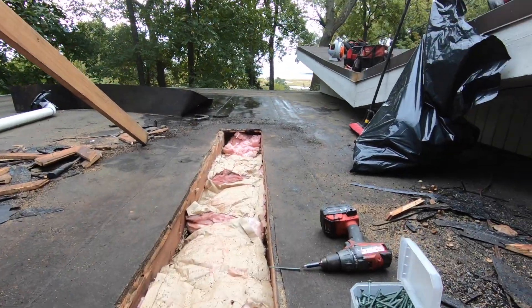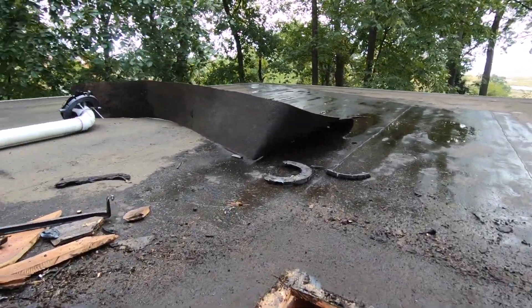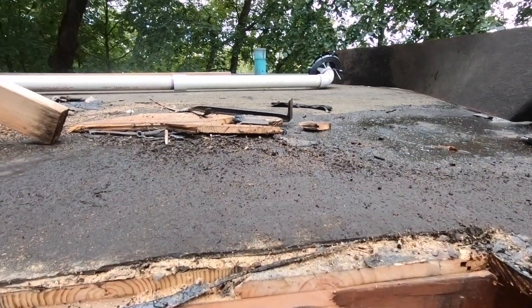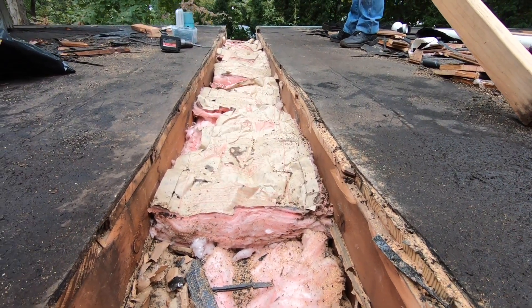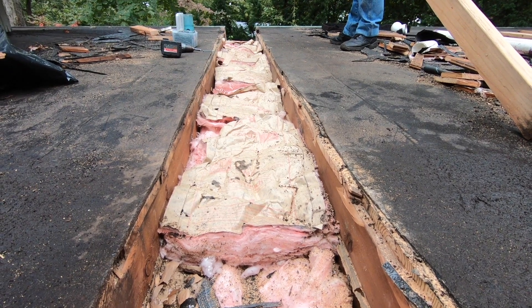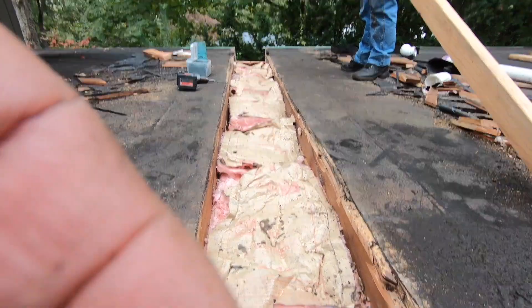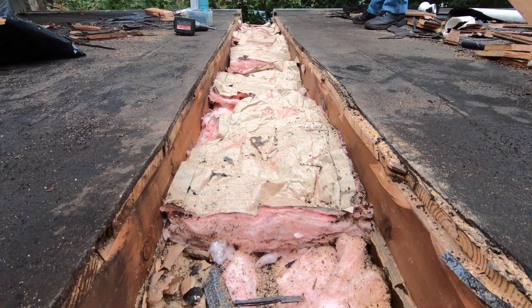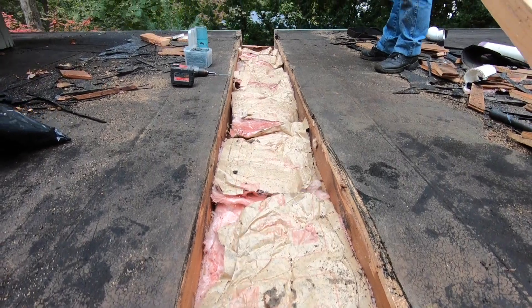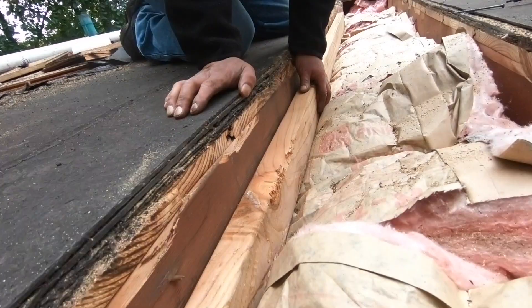The low end was there at the end — that was the low part of the roof. We're going to go down at least five or six inches. This is about a 12-to-15-foot channel, so it's quite long, but it drops tremendously, which is nice. We insulated the underneath of the channel so it doesn't lose heat or freeze up on the inside.